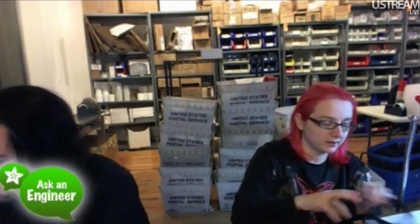You can export your project, and you can use compilers offline, and for the people who like to use open source tool chains, you can use ARM GCC and write your programs. And we'll have an example for that soon too. Kevin Townsend, who works with us, he uses that pretty much for all of his stuff on the ARM board that we have. The LPC 1768 is a sweet chip, and then it comes with this really nice little card with all the pinouts, and a mini breadboard.